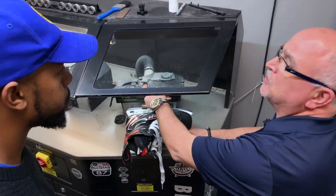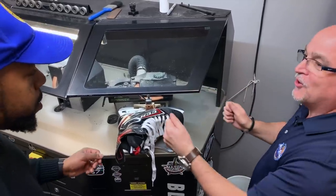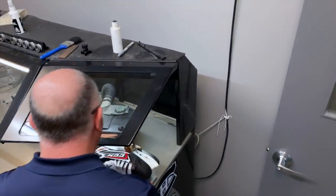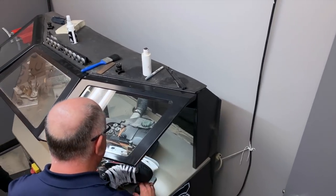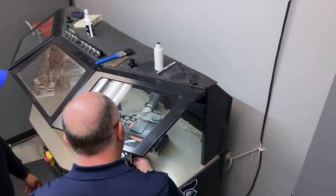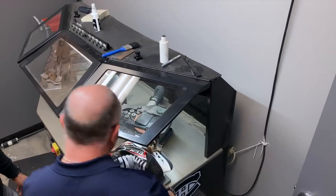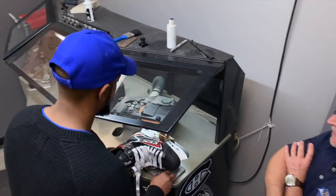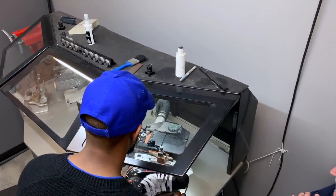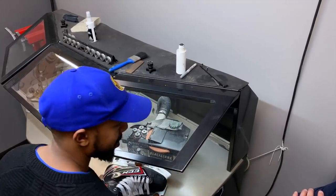That's normal — anyone who starts to learn sharpening tends to push into the corners. So you manage your pressure so you don't burn the blade. Go nice and slow — rotate up all the way to the point and keep the same pressure. Don't push into or drive into it — go ahead. Better — go again.